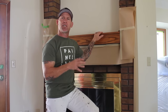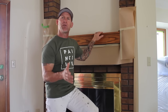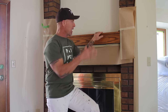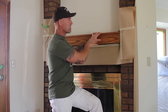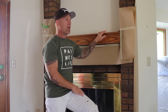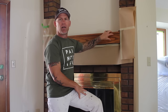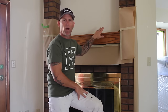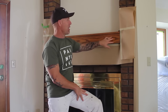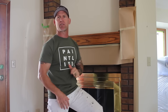I'm going to show you how we go about doing that. It's just spraying and back brushing and spraying and back rolling this whole thing, using the right product — not a paint but a solid color opaque stain. I've got this mantle all masked off right here. It's another project we're working on: an oak mantle that's really grainy. They want it white too, so we're going to be putting a grain filler on it and painting it also.